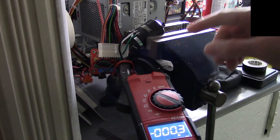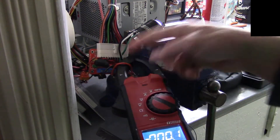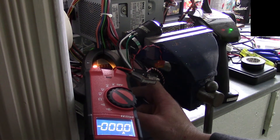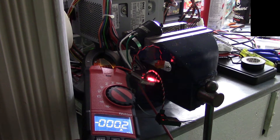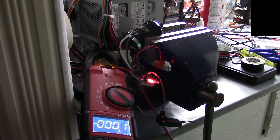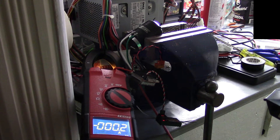One final test we can do is, again, with this brushless motor — on the input side of its drive, we can test the DC current going into it. Turning it on, it draws around 0.1 to 0.2 amps. With the control at half throttle, we're measuring around 1.2 amps, which is consistent with what is measured on the output side.